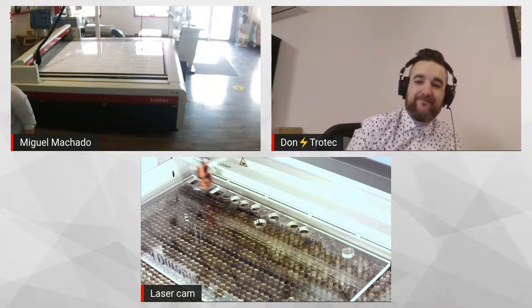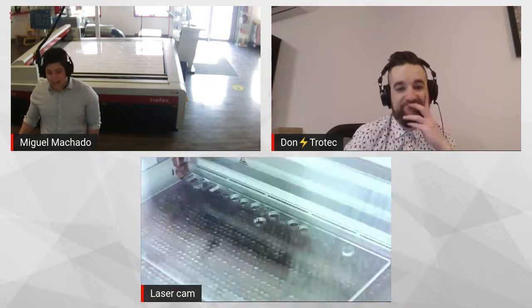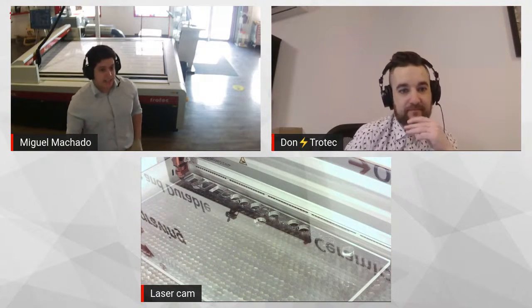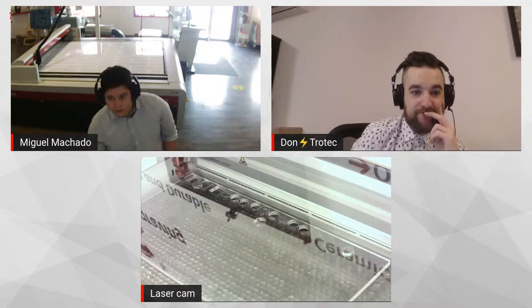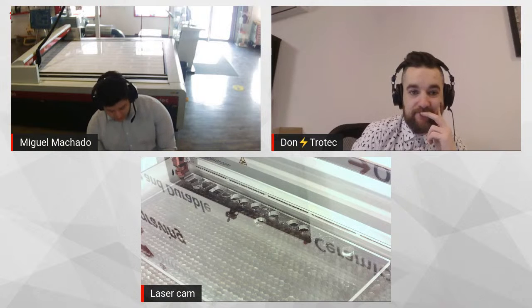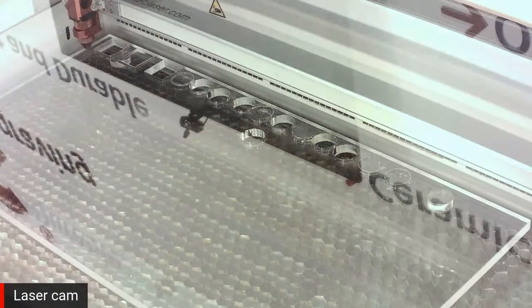So clearly that was quite dangerous. But you see, it didn't have enough flare-ups, and you thought, okay, it should be fine. But no, at the end, it flamed, like, hard. Simply because it took enough time for the gas to build up. Laser hit it. Boom. So it's not that hard to make that mistake. So now I'm going to go a little bit quicker. I did the test, and I'm going to do it at 2.2% speed. And I remember that this was decent. It did a good cut. Okay, come on.